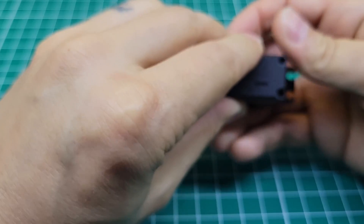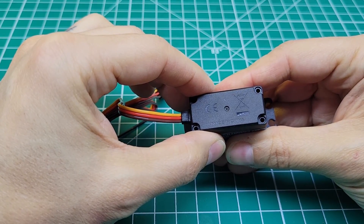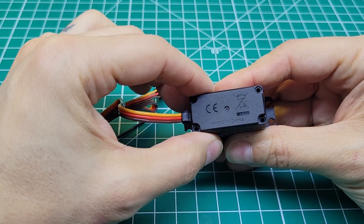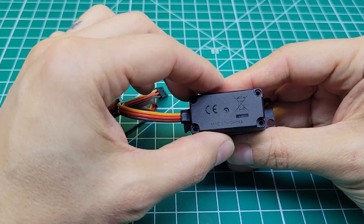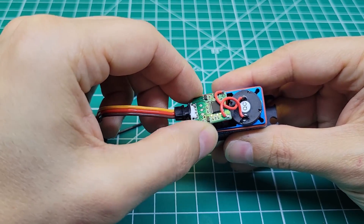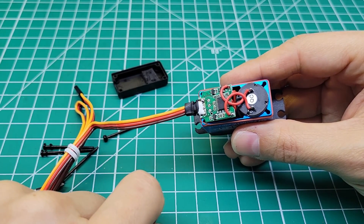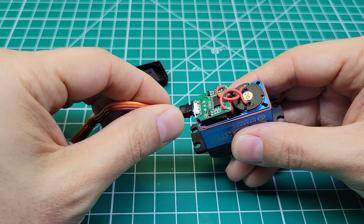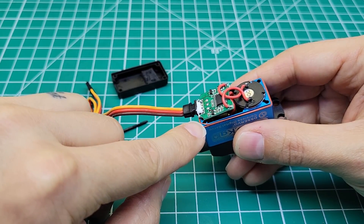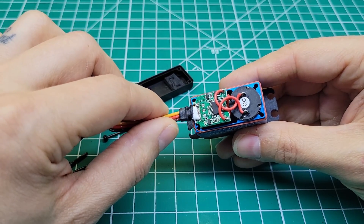Screws are out. Now on the bottom, I expect to see a standard brushed motor. It says it's coreless, which just means that the part that spins is a little bit lighter than a normal brushed motor, but it's still a brushed motor. So yeah, we have a standard brushed motor here. The board is just sort of flapping in the breeze, but there is a bit of sealant here where the wires go out, so that should be pretty well sealed. I don't see any water intrusion down here. Got a little pinch on the gasket, but it still should seal okay — I'll fix that when I put it back together. Everything looks good down here.